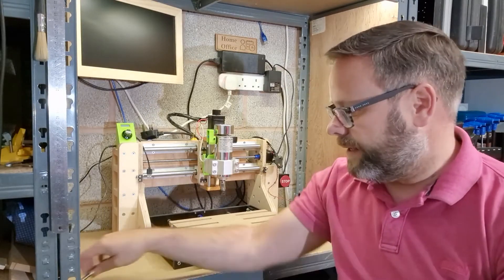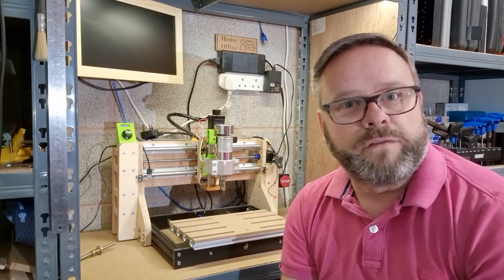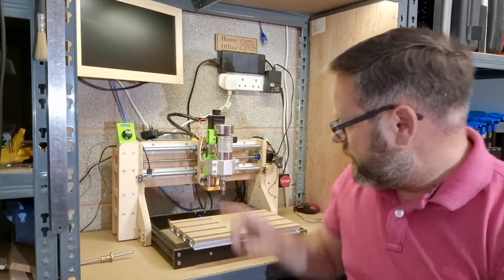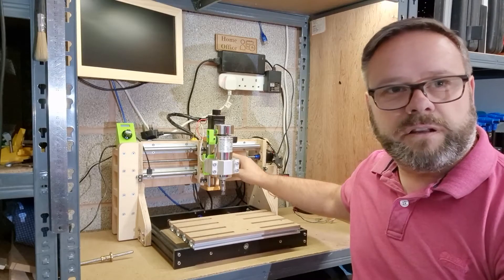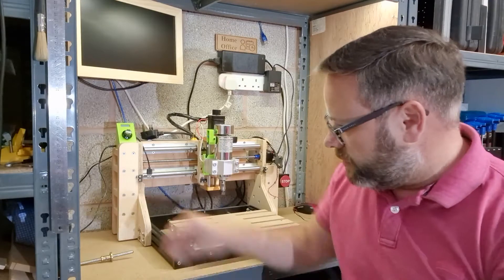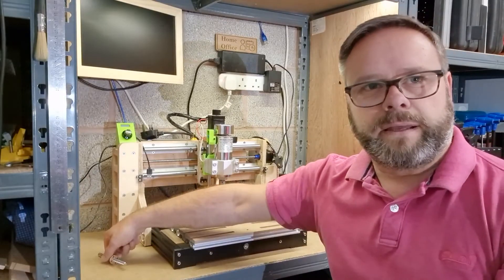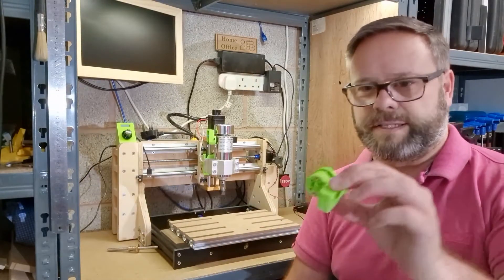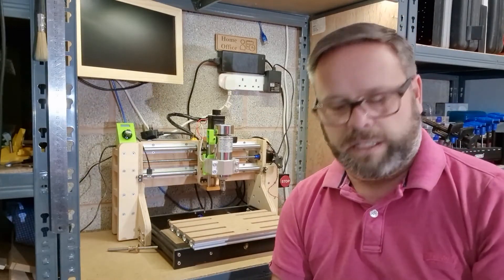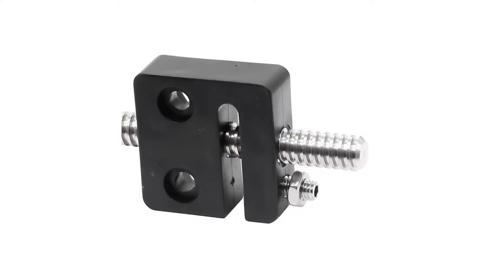So how are we going to deal with it? I'm going to try something today that doesn't involve swapping everything over to ball screws. We're going to replace the existing nuts with a printed part that I put in here initially. Print quality is not particularly great on this but it doesn't really matter. If I was going to design this again I'd probably make it flat straight across, easier to print. Let's put it on and give it a go.